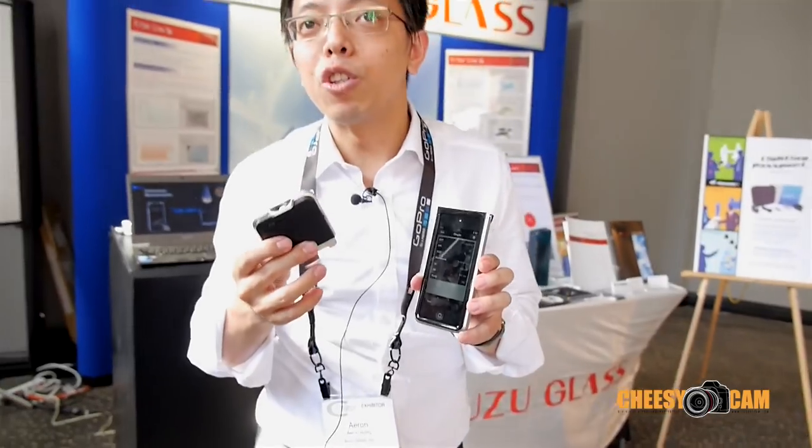In some special situations, you not only want to measure but also want to set some data filters. For example, if you want to check your light source within a certain range of color temperature or color rendering index, you can set up the range in the data filter. After measuring, you can check whether every light source is within or out of the spec you set.